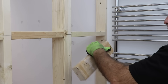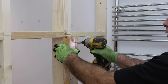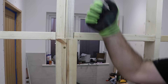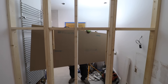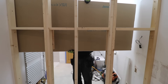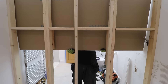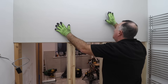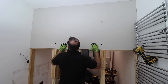If you want to see how to cut plasterboard, go and watch my video on boarding a ceiling — link in the description below. For this project I'm cutting all the plasterboard in the workshop and bringing the cut sheets up one by one. To make sure I get a nice tight joint at the top, I start fixing with the top of the three sheets first — it's not the easiest approach but it's the best way to get a good fit where it matters and where people might see it.